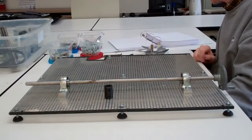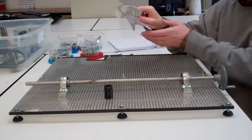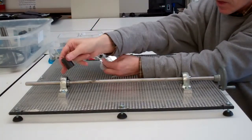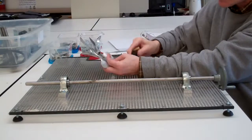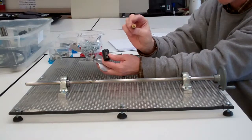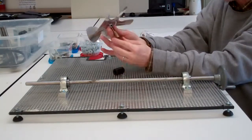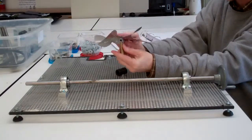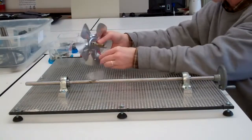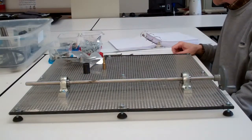We're going to be operating a fan. When you mount the fan, you need the shaft coupling on the end of the 24-inch shaft, and also a brass reducer — a part that reduces from a half-inch shaft down to a quarter-inch, which is what the fan requires. You'll need both of those parts to mount the fan.